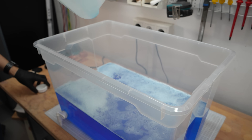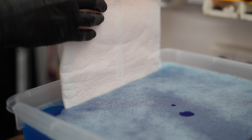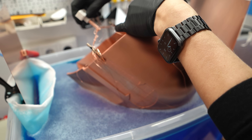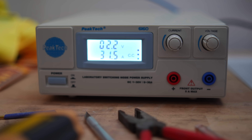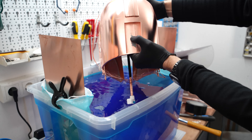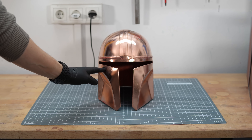But the video is meant to document a feasibility study, so why not. Put in the anodes, make sure these match your print surface area, and connect them to the power supply. Try to submerge the helmet, find out that it actually floats, and find a solution to keep it inside the bath. The whole plating took around 10 hours. I adjusted the current to 31 amps after 1 hour. And this is what came out in the end — beautifully shiny and with an incredible weight of 1.3kg.